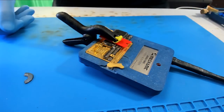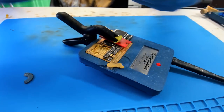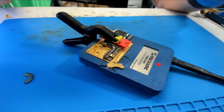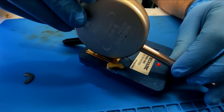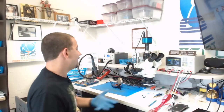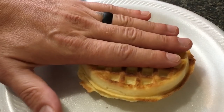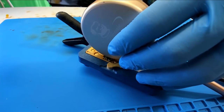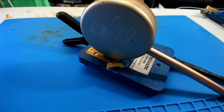And then I'm going to use a tool that was donated to me by Union Repair. I still use the wire off of it, but I don't actually use the dispenser. We are going to lay that right here to hold the tongue down. Honestly, there's really nothing like having the right types of tools for the job. We are going to let this heat up until the solder is all molten once again. There we are, we are all the way up to temp here. Let's go ahead and turn our burner off and let that cool under pressure.